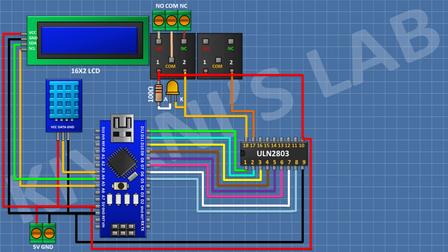Connect a 5V relay with its coil pin to pin 17 of the IC. Connect a 3-pin terminal block: one pin to the normally closed terminal, the center pin to the common terminal, and the other pin to the normally open terminal. Connect an LED with its cathode to pin 17 of the IC, and a 100-ohm resistor from positive supply to the anode of the LED.